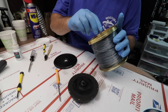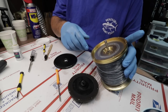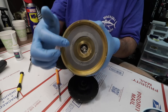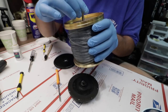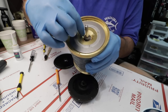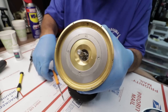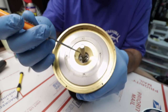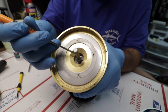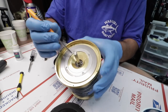Not much to do to get this clean. What you can do if you really want to — I've done it before — is take this whole assembly out. There's another bearing in there I'm going to oil. You push this pin down here — you see there's a spring right here — push this down and the pin comes out, and that whole thing slides out. I'll just go ahead and show you guys.